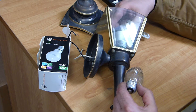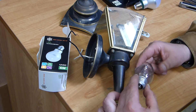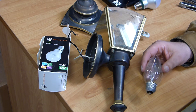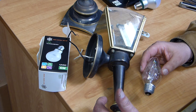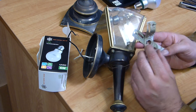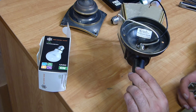One of the things you're going to run into is, depending on how you're trying to style something — and what's kind of fashionable here in Portland is repurposing older stuff, especially if it's kind of like a steampunky type style. Realize that when you get a hold of antique fixtures or vintage fixtures or something like that, they're going to be cost-prohibitive to sometimes make new fixtures, or if you want that kind of weathered or antique-y look. This thing had this type of fitting inside, which kind of tells me it was probably late 80s, early 90s. Also, with the printing inside here, it was a UL-rated light.